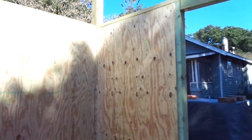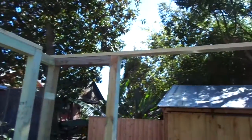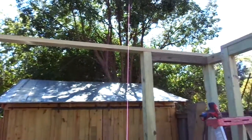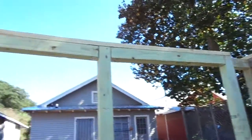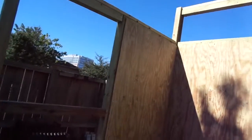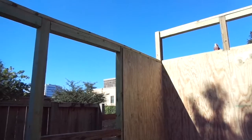Good morning. We're here at this garden shed project. Last time we completed the box, then capped all the framing with the 2x4 all the way around. Today we started sheathing the inside walls with half-inch plywood.